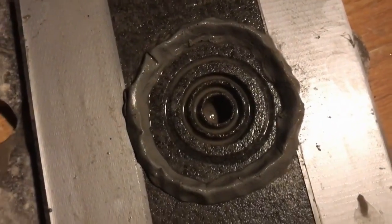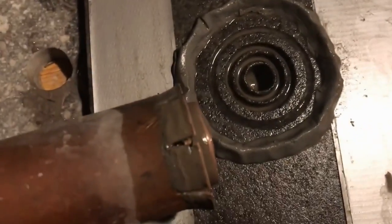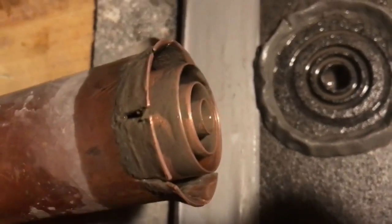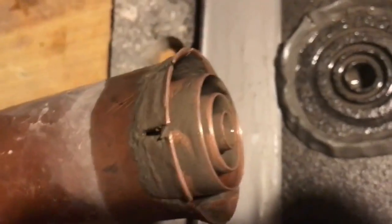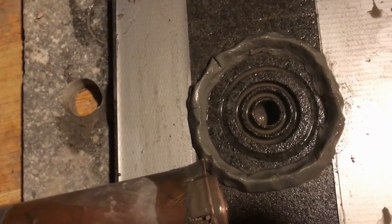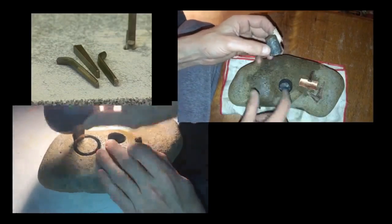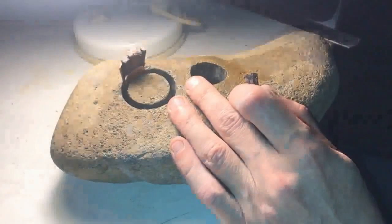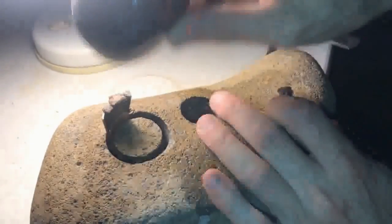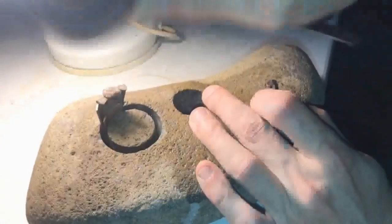However, I wouldn't even have to do that step, because instead of having a single tube I would use tubes within tubes within tubes — which means I wouldn't even need to pop it out, because I could break it apart since the walls between the pieces are so thin. I made a series of granite rings with just about a millimeter and a half wide tubes within tubes. Instead of popping out the core you drill like this, and those rings are so delicate — when I got the ring out I dropped it on the floor and it shattered. So tubes within tubes: you don't even need to pop out the core; this thing just disintegrates.